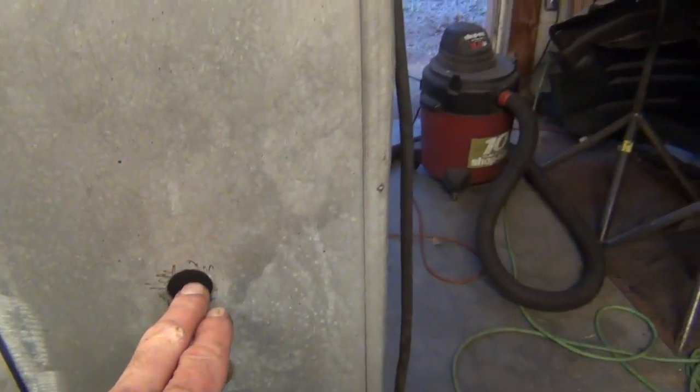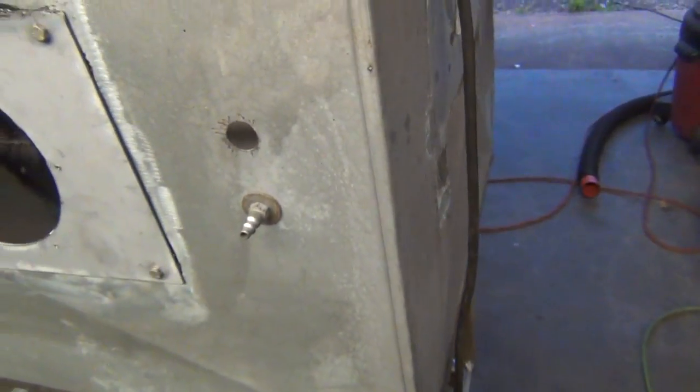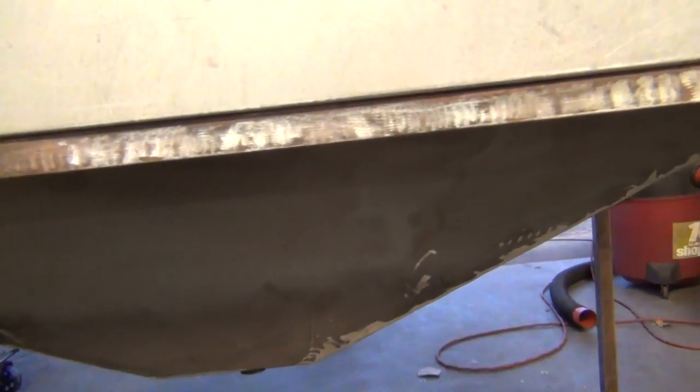And I'm gonna do the same thing with this one. See, I got one there and one on that side. And I'm gonna do the same thing with this one. Because my hose went in here, and I used to have my hose run down to the bottom of the funnel, and I may end up doing that again, but I'm going to try just doing like most of them are and having the hose going down on the inside. That way I won't have a hose sticking out of there. And it might be easier, if you get a blockage in there, a big chunk of rust or something that's messing up your sandblaster gun, to blow it out than to have it all plumbed and hooked up solid at the bottom.